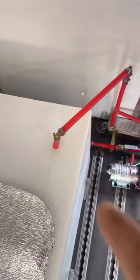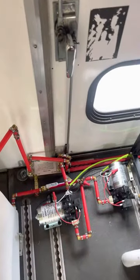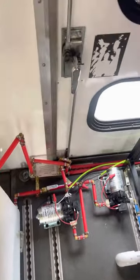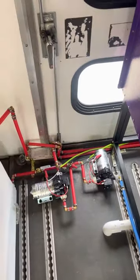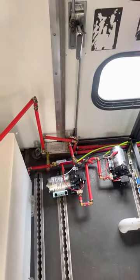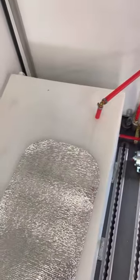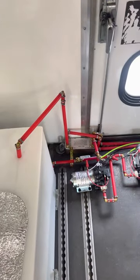The outer plates carry water from the tub back into the tub. There are about 20 plates total — 10 for the engine circuit and 10 for the tub circuit. The engine water is at 180 degrees, the tub water might be at 60, but since the plates are touching they'll try to equalize.